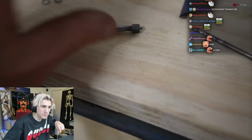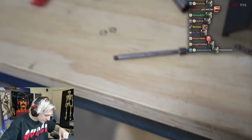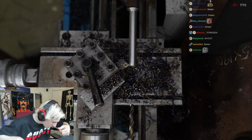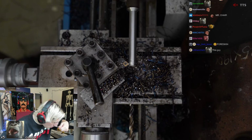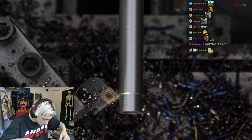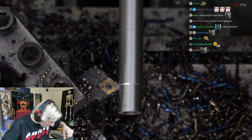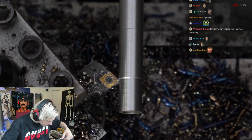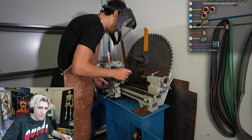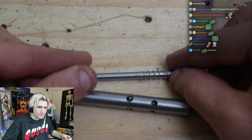And I really should have had some more foresight, and known that the mild steel would misshape and give out like this, which now means I need to make the whole thing again using a stronger steel, using this stuff here, called 2160 or 5160 or 1300 700 904. I don't remember. So I remade the whole device again, but this time without any jokes. And I also made the piston much thicker, which should now hopefully survive.